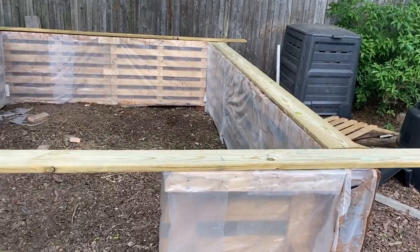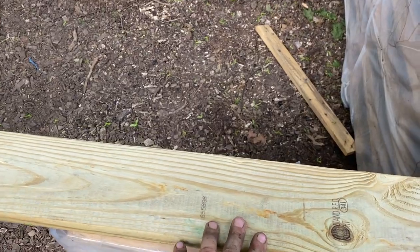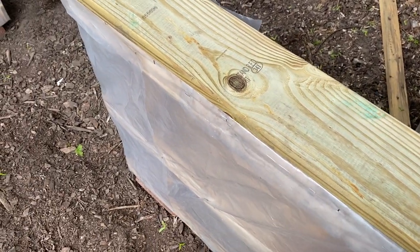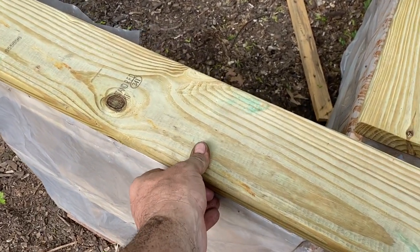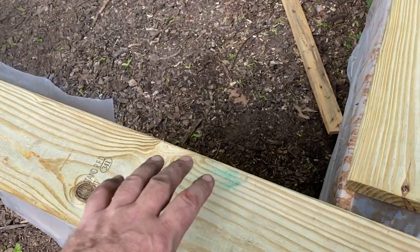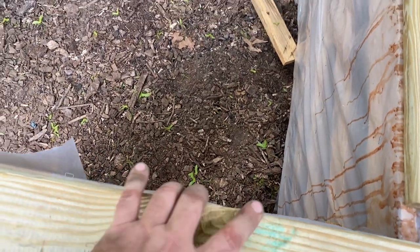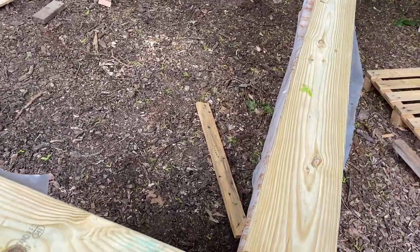As you can see on top, I've also got decking here — this is five-quarter decking by six inches. It covers the width of the pallet perfectly. But once I put the siding on, I'm going to cover just the tops of the outdoor siding, leaving just a slight lip. Then when I put whatever kind of finish on the inside, it'll be a little bit of a reveal on that side. This will be the shelf that ties it all together.